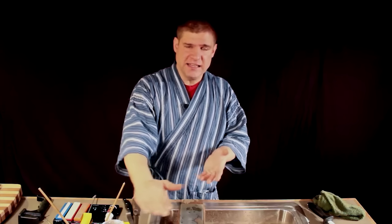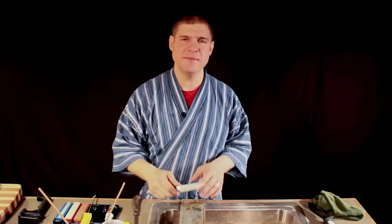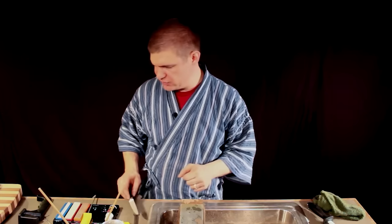So that's how you can use any other medium out there. And I half-jokingly said you could use the lid of the toilet reservoir, and you can if there's exposed ceramic on there. But again, you would do that by bringing the edge backwards. I've used the bottom of a ceramic plate, the bottom of a coffee cup, river stones. I even one time polished a blade by pulling ashes out of the fire and rubbing them into the bark of a tree and stropping backwards that way. And the silica in the ashes abraded some steel away and made it sharp. Again, anytime you're on a questionable surface, stropping backwards will always give you a sharper edge.